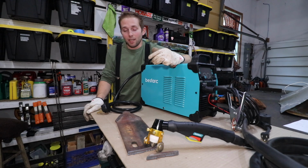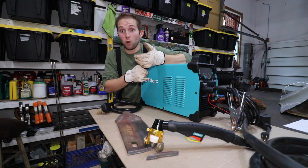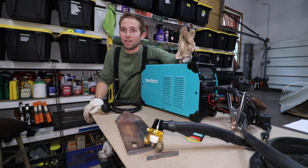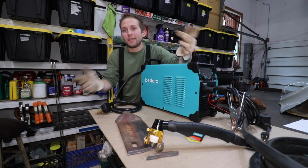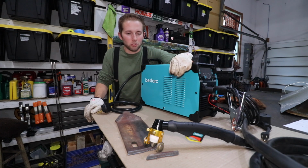But on the other side of things, think about it from a fabricator's point of view. You know, doing any kind of welding or plasma cutting on 110 voltage generally is not recommended. And really, if you're doing fabrication, you have to be on 220, 230 voltage. So for it to get 2 inches in the 5/16 plate, it's kind of impressive, but also, again, just put a bad taste in my mouth that it tripped the circuit breaker.